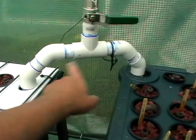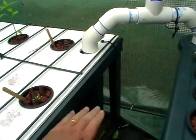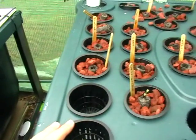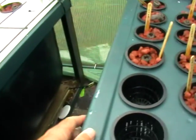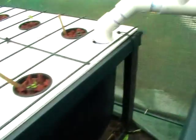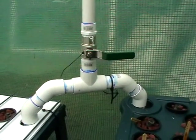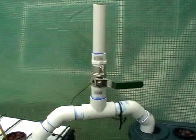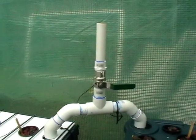Both tanks after the little suck method — creating the siphon — are now full of water with no bubbles. This little U-bend is creating a perfect equal level between both tanks. In about an hour the pumps will come on to empty this tank back into the big 4,000-litre fish tank. When that happens it'll drain this one at the same time, and when the gravel grow bed starts emptying back here, this one fills up too. The water levels have dropped right down — perfectly equal. Really simple gravity, very cheap — a couple of bucks to make.